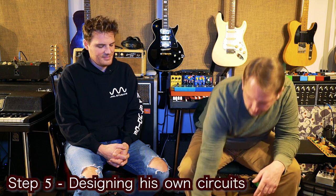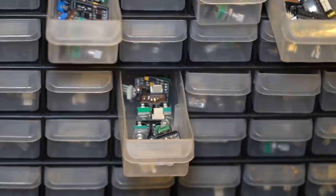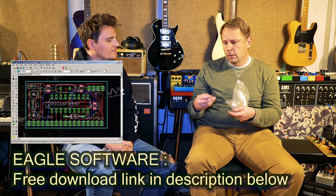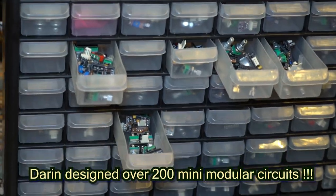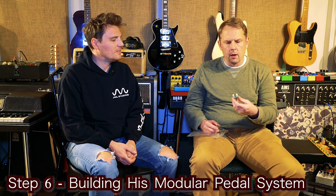The next step in my journey was to actually start designing my own circuit boards. At the time I was living in a small apartment, so it was hard to keep my living space separate from my work area. That's when I started designing really small circuits. Here is a small circuit board that I designed using design software called Eagle. There are a couple things unique about this: first, it's a very small circuit with a lot of components packed into a very small space. It's also two-sided, and there are surface mount devices that I apply by hand to both sides, which allows you to really pack the circuit in tight. I standardized the controls on these things so they all fit kind of the same.